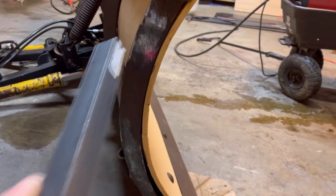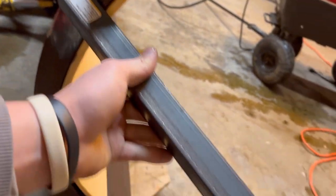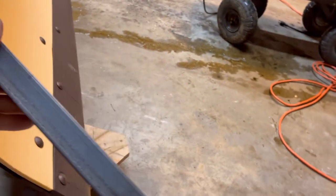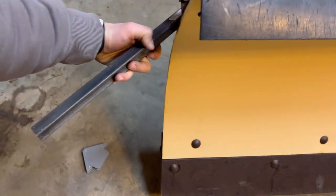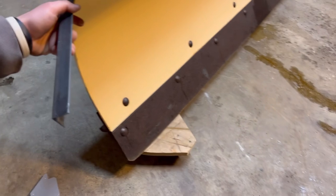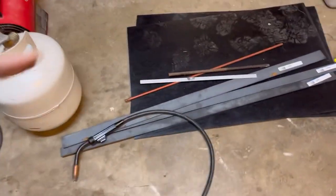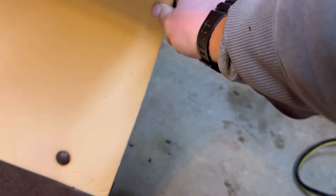What I'm going to do is — you see right here how that's at a 45-degree angle already — I'm going to weld steel to that, and it'll come out at an angle so it'll be more of a scoop plow. That should help a lot, add quite a bit of width to the plow, and help contain the snow. I'll probably have three of these going down, and then I've got these sheets of rubber that are a quarter inch thick — those will be my moldboard.